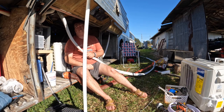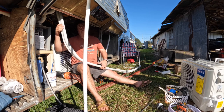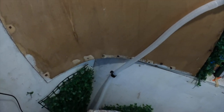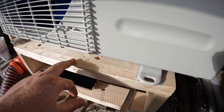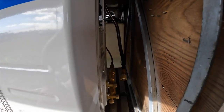Our next step is running the lines from the bottom up. It just seemed to work better for our configuration. Had we done this when we first built the bus it would be so much easier, but now we're having to work around a lot of angles and issues. Sometimes you just have to wing it and pivot because things aren't working right. We went ahead and ran our drain line to the air handler in the back. We made sure it was at a downward angle and it comes out the floor of the bus and onto the ground. We finally got our line set ran the way we needed it. I built a little stand here to raise it up a little bit because I was that close on line set. Once I get the lines connected I'm gonna screw it down and then we'll try to turn it on.